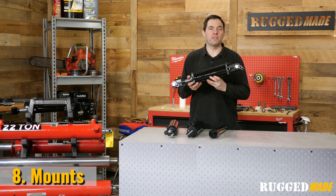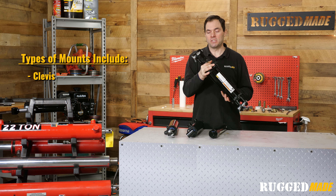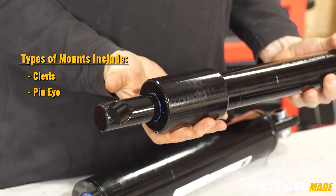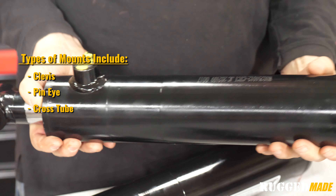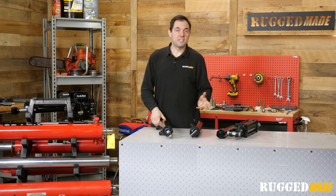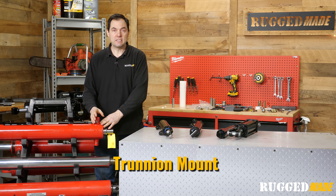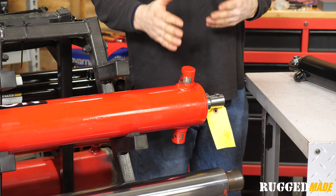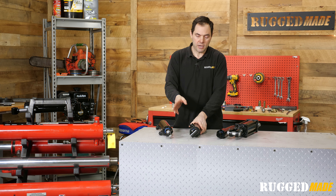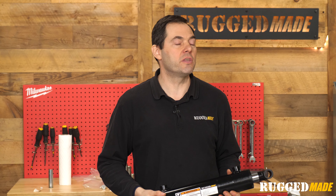A cylinder needs to be mounted with at least two points of contact — one somewhere along the barrel and one at the end of the rod. Common mounting types include: clevis, cast fixed clevis on the base, pin eye mounts, traditional cross tube, and ball swivel. All of these examples have a mounting point at the rear end of the barrel, but sometimes cylinders can mount in other ways. Here we have an example of a trunnion mount where the ears are very close to the rod end of the cylinder. Another similar style would be a flange mount where you could weld a plate anywhere on the barrel and attach it to your machine with bolts. Keep in mind the cylinder doesn't have to use the same type at both ends — there could be a mix of clevis and cross tube, depending on how the cylinder needs to mount to the machine.